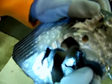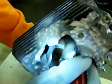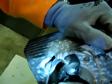Another thing is that things like the 1MC can run left-hand carbide burrs. You'll find those online at ccspecialtytool.com, and they're good for doing the contra angles, like the ones that are kind of hard to pull against. I like to be pulling against the carbide burr as I'm running. Let me get a little bit better angle on this. I like to be pulling against it, against the cut of the carbide burr. It helps it run nice and smooth.